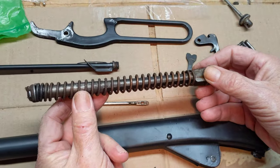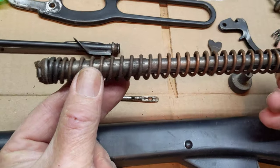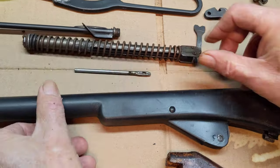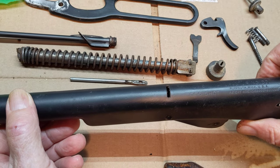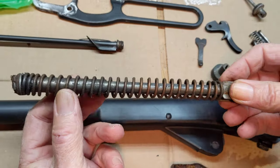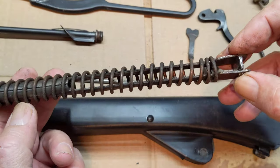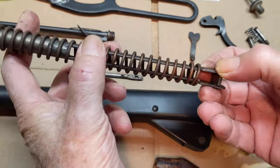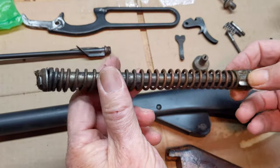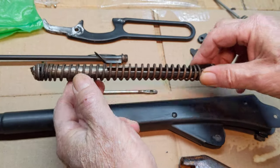On the spring on this gun, we can see it's copper washed to a certain degree — you can see a bit of color. So this is probably the original mainspring that came in the gun. It's a 155 Plymouth gun, so that's probably a mid-30s manufacture. Another thing we look at is the plunger assembly itself. Back plate's in good shape. I don't see a lot of scoring or scarring on the plunger legs right through here from being stropped repeatedly by the force of compressing the spring. Our next step is we're going to pause the camera and set up the mainspring extraction tool.